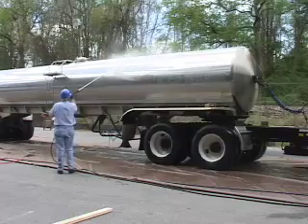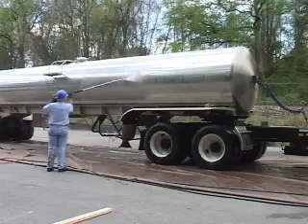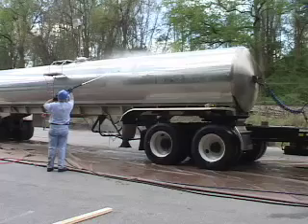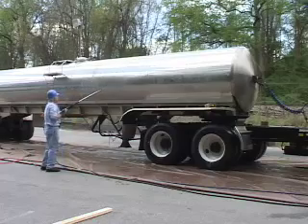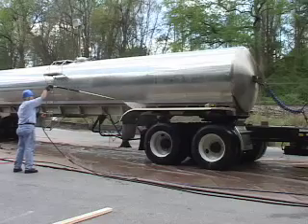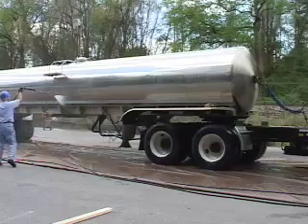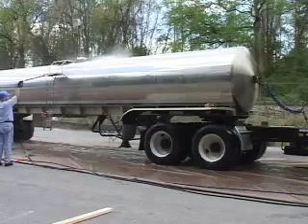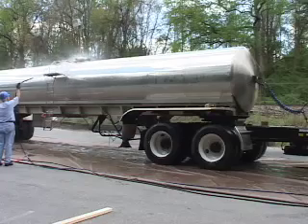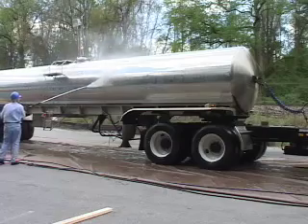We found that in order to neutralize that water before discharging it — to sanitary sewers first and storm sewers second — the way to do it was to neutralize it in those 150-gallon totes, which we show later. We tested several methods and the only economical and best way was to pick that water up and put it into a holding tank, as it was too difficult to get good neutralization on the tarp itself.